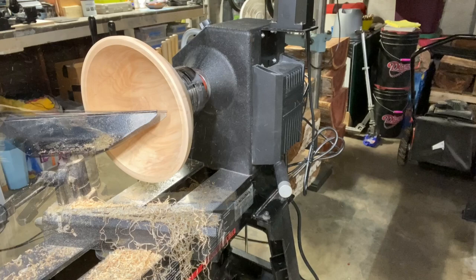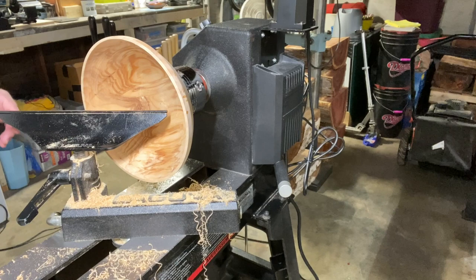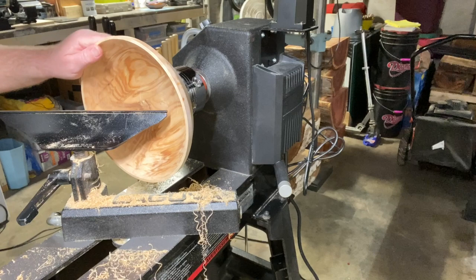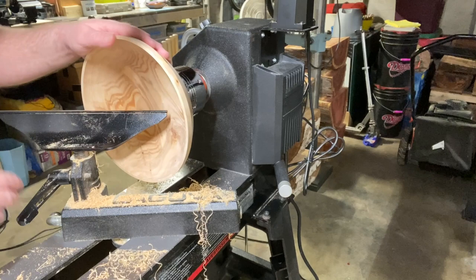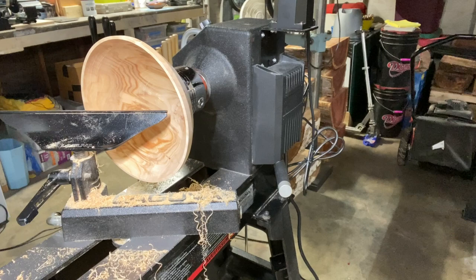Filming some again, but I got it down to 3/16 of an inch all the way up the walls of the bowl. So I'm going to do some scraping, see if I can smooth some of those tool marks. I'll round over the corners a little bit when I'm sanding, but I want to see if I can clean up some of the bottom. I don't know if you can see that old wound that was in the bottom of this, it's almost turned out. It's just nice and colorful. So anyhow, see if I can clean up the bottom of this just a bit before we start sanding.